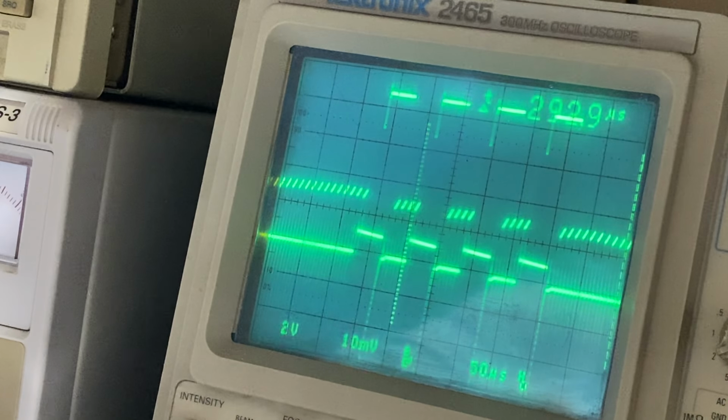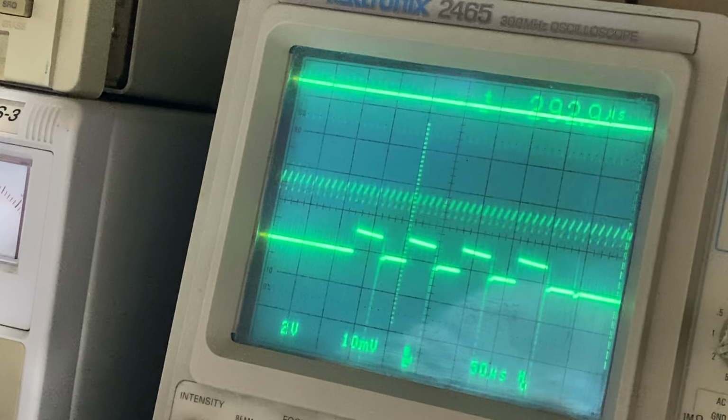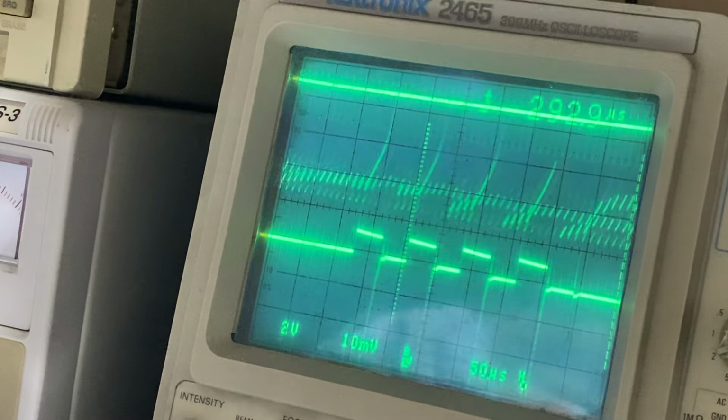But the other thing you could do is put a very, very small capacitor, I'm talking small, maybe 100 picofarads or so, from that test point, well, people call it a test point. It sort of is, I suppose. It tells you that transistor's working. But what you could do is, from that point there, or from the transistor, or one of the resistors or capacitors that connect to that point, you can find it and beep it out with a multimeter, and connect a small capacitor to ground. It might clean up the supply a bit more. But yeah, that's me with my thumb on it.